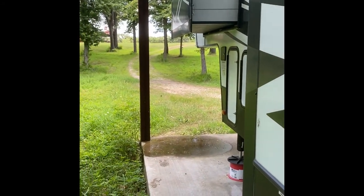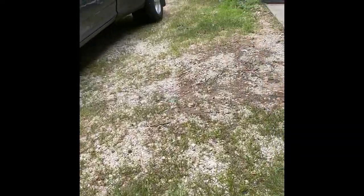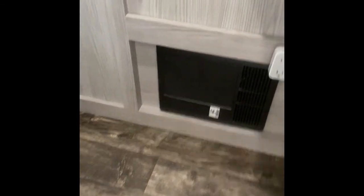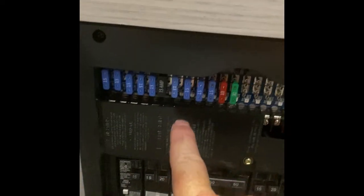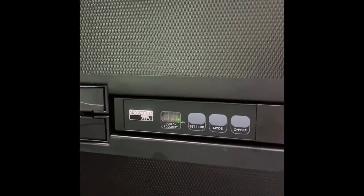Well, that's not exactly the case, because I walk in like we're doing right now to show you, and the refrigerator still wasn't getting the green light on. So, you know, what the heck? Poked around, got more frustrated, said a few choice words, and lo and behold, I took this fuse panel off. Real simple. It comes right open, and that fuse right there, if y'all can see that, had a red light on it, telling me it was no good. Put another fuse in there, and looky here. I got a green dot on my refrigerator now. Yes, sir. Refrigerator now has power.